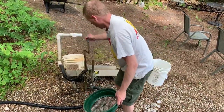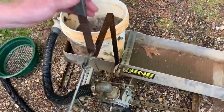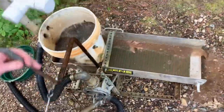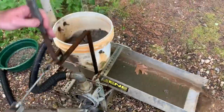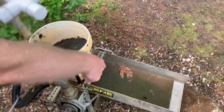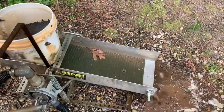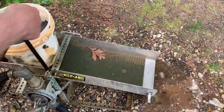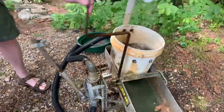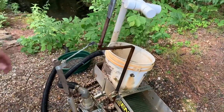I'm going to turn it on down and see how it's working. A lot of the water is going over to one side right now, but if I were to level this out a little bit more and the suction was working better, we would start a little sooner. You can see the matting there — it's got some green carpeting that was originally in the sluice. It is gathering; most of it is gathering on that side. Most of the water is coming out on that side, so you can adjust the box downwards a little bit to get the water to pull a little more evenly.